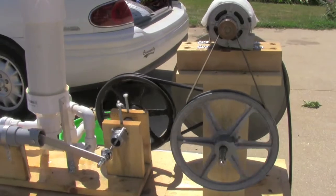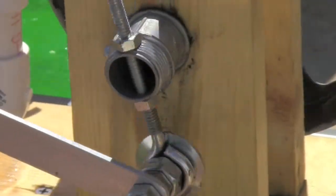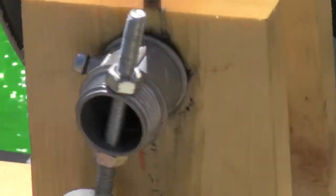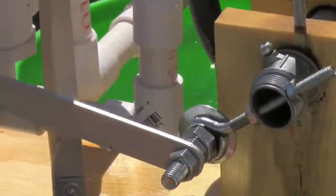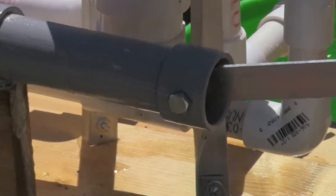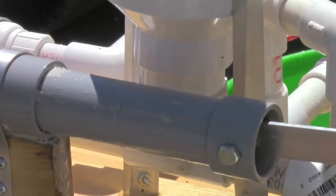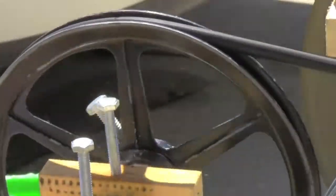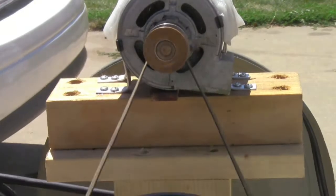And here's the other side of the machine. Basically, this is just a piece of conduit. It has the axle and a junction box to conduit connector right there. As you can see, an eye bolt, an elevator bolt, and some nuts and bolts for that. And then just a piece of aluminum for the crank. And then for the piston, there's just some pieces of stuff in there — pipe to keep it in line. And it works pretty well. It does have quite a bit of torque at the last pulley. And the belt for this one is just actually a printer belt.